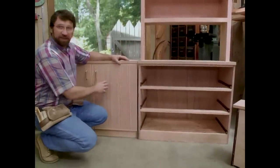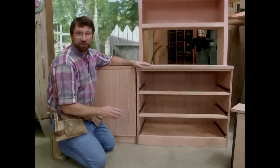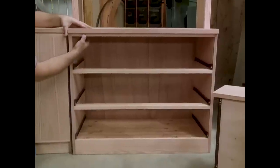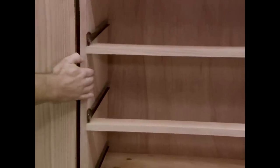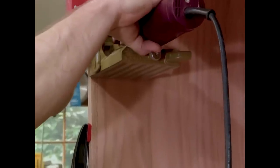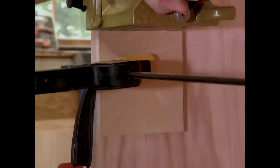So far, both the door case and the drawer case are assembled the same way. There are a couple additional pieces: both will get a toe kick board, and both will get a little cleat underneath the countertop. The drawer case, however, gets two additional pieces to separate the drawer cavities. All these pieces are joined to the sides with biscuits. Here on the side of the drawer case, I've laid out for those rails that separate the drawer cavities. It's always difficult to hold a biscuit joiner on the line steady, so I find it helpful to just clamp a scrap of wood right on the line — then the biscuit joiner has a place to sit.